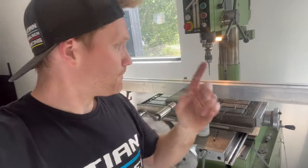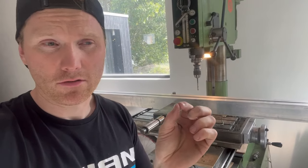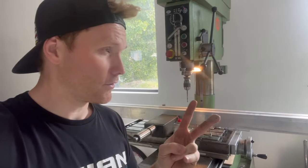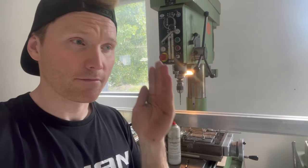So I'm making the holes. For the first two bolts, I'm going to mount it into the support in the roof there. I use 9mm holes and I have 6mm bolts. That means I have 3mm to adjust on. When the first two bolts are up and it's adjusted correctly, I have other holes where the 6mm bolts fit perfectly. So I'm sure it's not going to move later on. The first two holes are bigger just to have a little bit to adjust on. When it's adjusted perfectly, I bolt on the other 6mm holes with the 6mm bolts. Then it's for sure going to stay there.